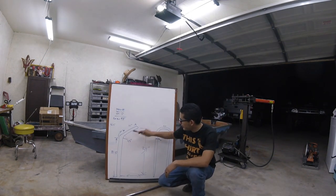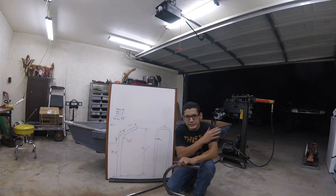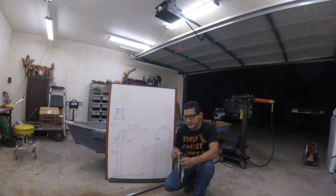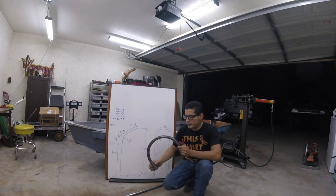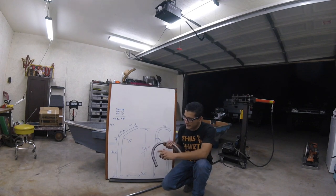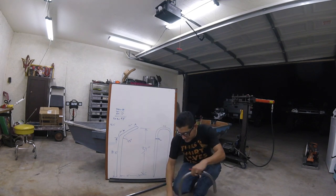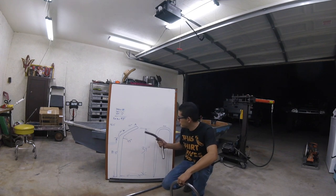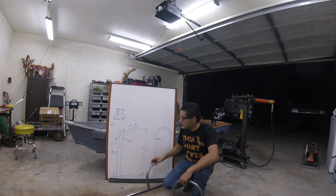I already did some measurements. The total height I want is for it to be 34 inches. These are nice cheaters for a JD square tube bender. You make one for each thickness and diameter of tubing — a tool that's nice to have because for 180 degrees you eat up length of tube as you bend it. I already have marked different degrees and how much tubing is needed to reach that degree. This is the same tool but just at a 45 degree.